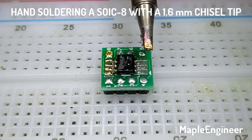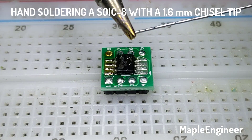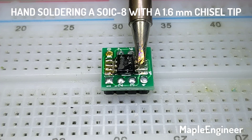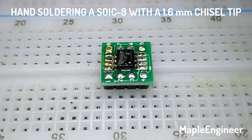Come back in, clean the soldering iron, add a little bit of clean solder again. Solder the other side of the chip — really straightforward. Then clean it up with some isopropyl alcohol.